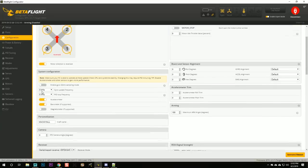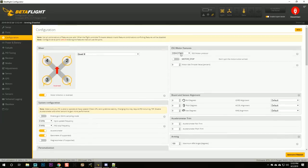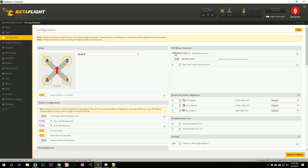BrainFPV confirmed that setting the Betaflight gyro and PID loop to 8K is actually equivalent to running the Bosch gyro at its maximum — around 2K — so just set it to 8K/8K and you'll be fine. Catalyst Machineworks also strongly recommends not running D-Shot 1200 because the signal lines are noisy given the electrical noise in the system. Instead they suggest running ProShot 1000, which moves the motor signal frequency away from the ESC frequency so they don't interfere. ProShot 1000 still supports all D-Shot functions like turtle mode.